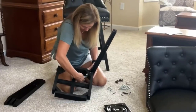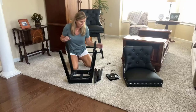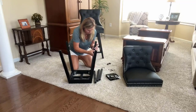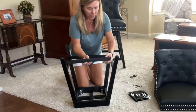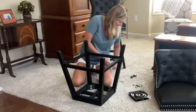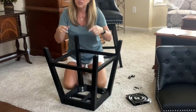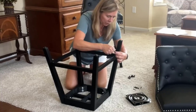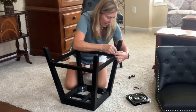You want to attach these nice and firmly. Do this for all four legs. Once you have the legs on, take these support bars and slide them in between each leg. You'll be given screws that go in and a tool to screw them together. This is solid birch wood, and each leg also has adjustable levelers so you can adjust the stool if your floor isn't level. Using the tool provided, screw each of these into the legs.